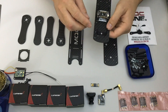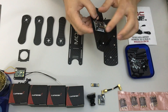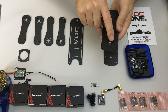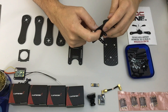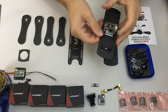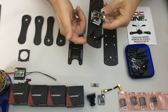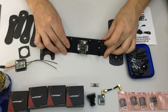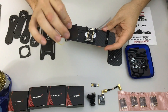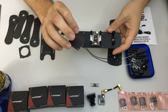The camera bracket has been attached. I won't be using a board cam — I've got the 1177. The frame has a wide slot and a larger hole in the centre for an M3 screw to mount it. The bracket comes with the 1177 and I've supplied the M3 screw and nylock nut to attach it. To show how the stack goes together: I have my PDB, then the flight controller, and then a small carbon fibre plate which came from Flyduino — it doesn't come with the MQC1 kit.